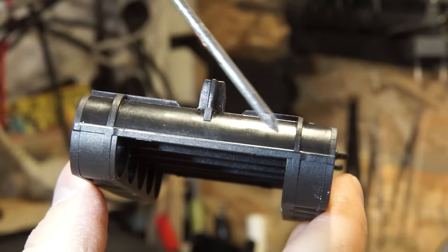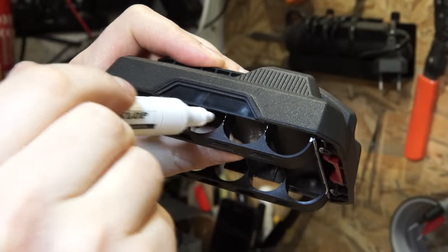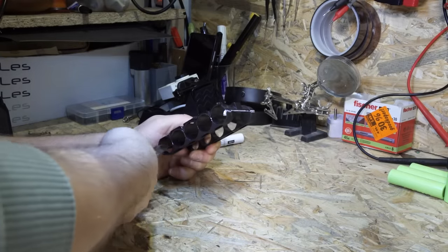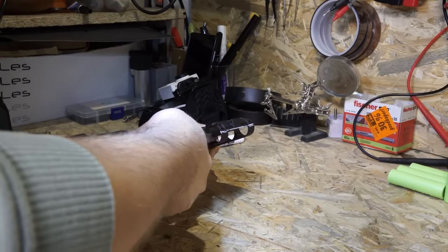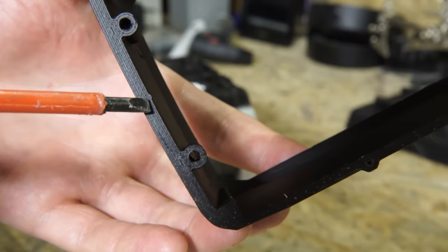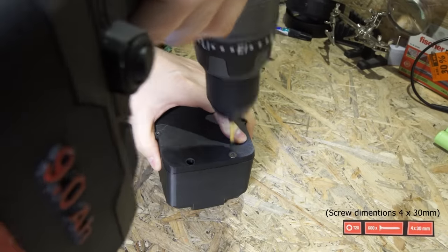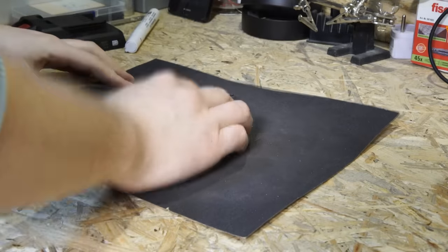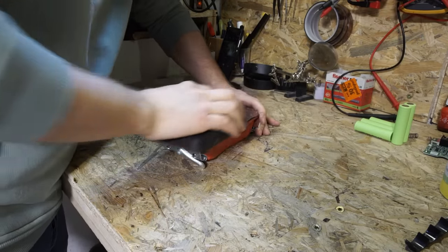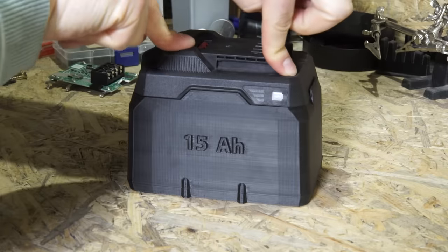Just like before when we removed all the plastic bits that were sticking out to get it flat on the table, we need to do the same with this part. I'll be using a white tire marker to mark where I have to cut. Next we use pliers to cut away the bottom part of the plastic — be careful not to cut away too much because then it won't fit right. Rather, sand away the excess plastic with sanding paper until it fits perfectly snug. There's a little bump in the top and bottom part of the design that must line up. Now with the batteries inside we use the smallest screws from Parkside to connect the two halves. Sand until there's no more wobble — the top and bottom part must connect perfectly. This is when it was fitting perfectly for me.